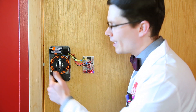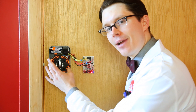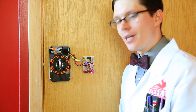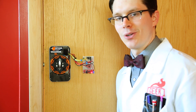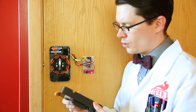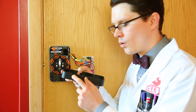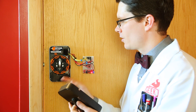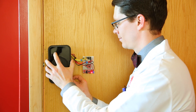One final cool thing about the Lockatron is that the rings are set up so that you can manipulate the lock by hand without having to activate the motor. The Lockatron also comes with this neat little cover plate so you don't have to stare at these ugly electronics the whole time. To route the wires to the outside of the Lockatron, I had to cut a notch right here in the plate so that when it fits over it, the wires can still be routed to the outside.